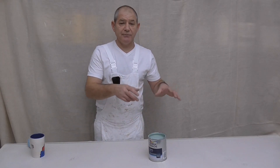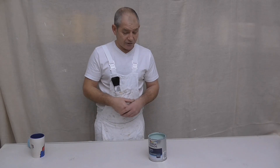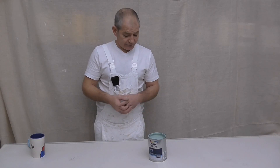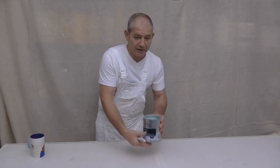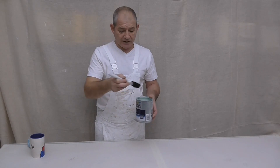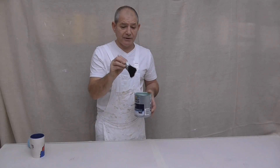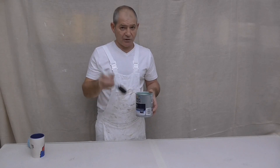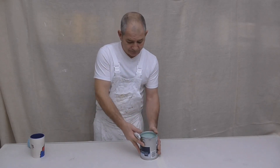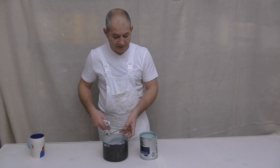When you put it down it either goes on your steps, onto a sill, or the floor — it's going to get knocked over, and if it does, it's all gone and you have to buy more paint. Fifth, brush loading — you can't load your brush properly. You tend to wipe it on the sides, ending up with a lot of paint on the end of the brush, which can transfer drips onto your woodwork. Too much paint loaded at once means a lot more spreading out — it's not the right way to do it.